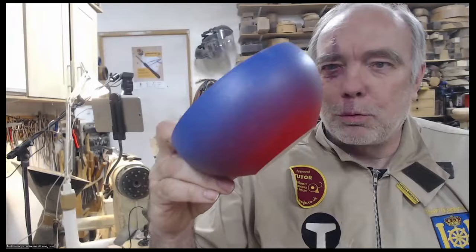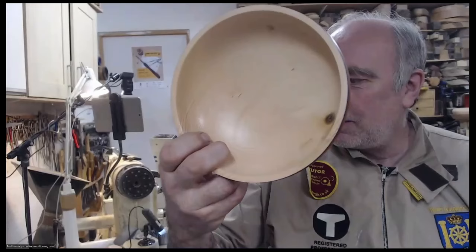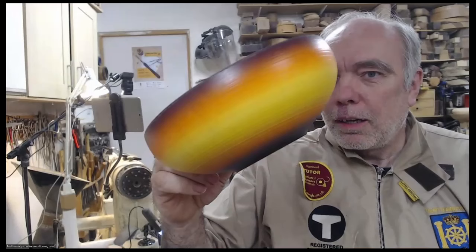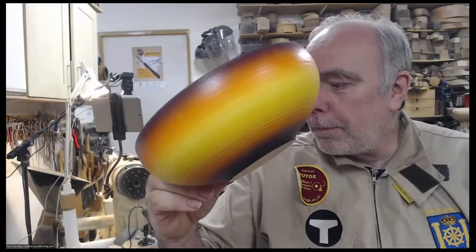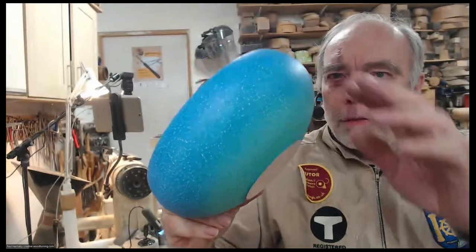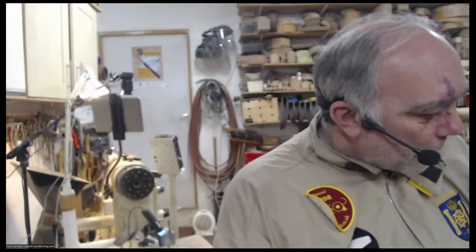There's another one here — this one's actually just pine, yellow pine, fairly simple. On the sides you can see it's more of a linear pattern, done with a brush using the same acrylic gesso and then colors over the top — purple, orange, and yellow. And then another one here with a stipple texture in green and blue, where I've actually sanded back the highlights slightly so you're getting white flecks where the heights of the texture are. By the end of the evening I will have shown you how to do all of those.